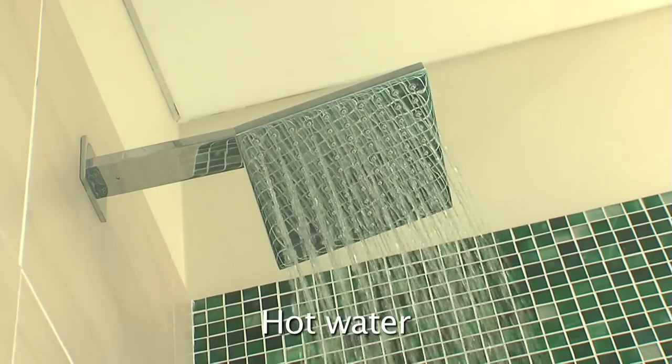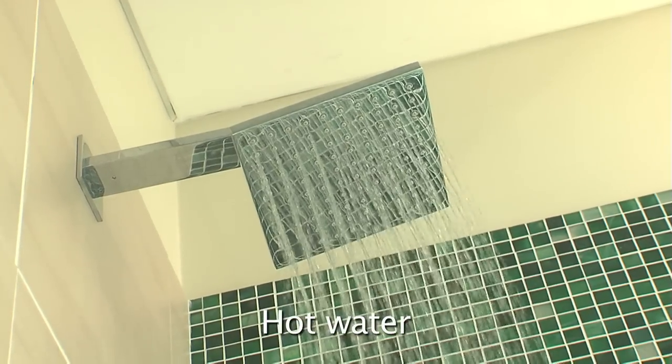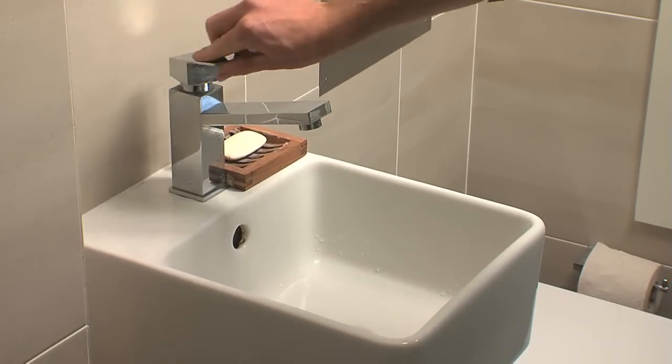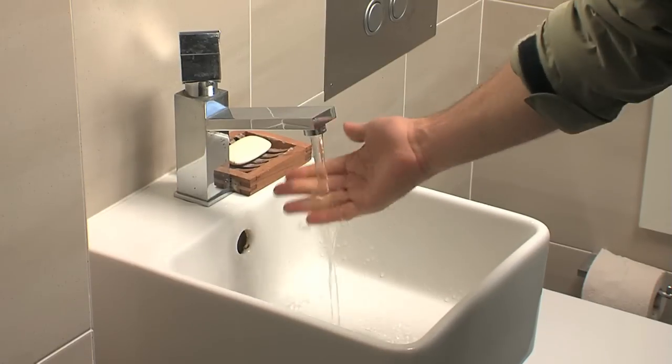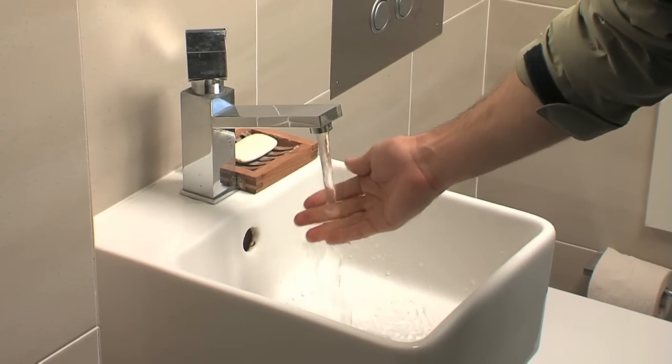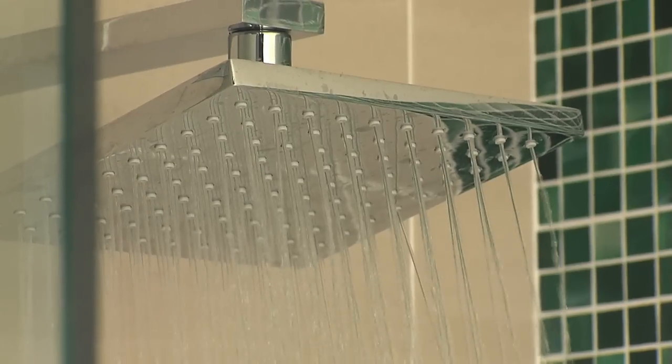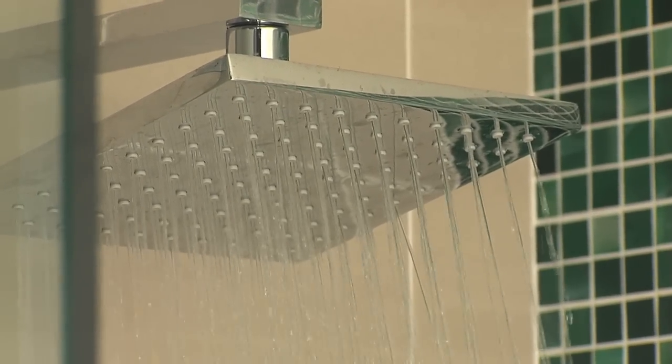You can also supply rainwater to a storage hot water system, though health authorities recommend using mains water if available. If the cold water comes from the mains, the hot water needs to be at a very steady constant pressure, or it can become impossible to maintain an even temperature in mixer taps or the shower. So make sure you have a suitable pump and control system.